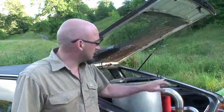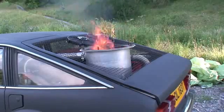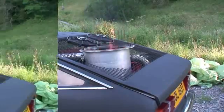The easiest way to get the gasifier going is to put some charcoal in or some kindling and set that on fire. Especially with this closed system, because we are going to put a lid on it and force the air through, it is important to get a really hot fire going first. Once we have got a really hot fire we can start adding the coffee pellets. Once they have started burning we will put the lid on and start up the fan, which will force the air through to get a really hot fire going.